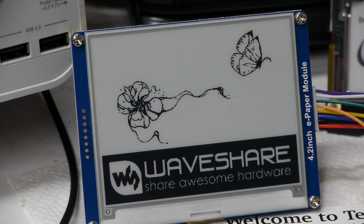And the early Kindle and other e-reader type things had this same characteristic to them. You can't just update the screen, you have to clear it entirely. However, if you know how to tweak the firmware, you can make the screen do anything you want. Actually, interestingly, the controller is very programmable, and it's sort of security by obscurity. You can load any values you want into the registers and cause it to do anything. You may hurt the display, but let's take a look and see what's going on.